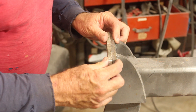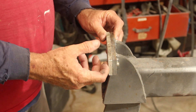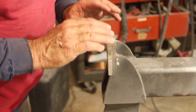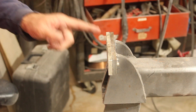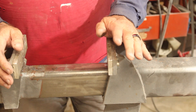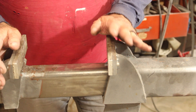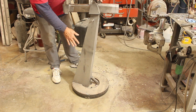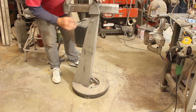These half-inch brackets worked fine, but this three-eighths inch jaw face would flex if I clamped something out on the edge. So we're going to beef that up — I'm thinking at least three-quarter inch, maybe one inch thick jaw on the next rendition. The aluminum jaw face worked pretty well so we'll stick with that. The maximum usable opening was realistically eight inches — I want that larger. Looking down at the pedestal base, the sundial idea is cool and it works so we can keep that.